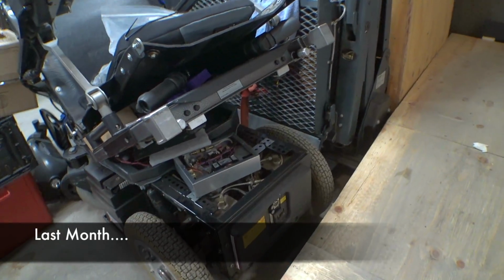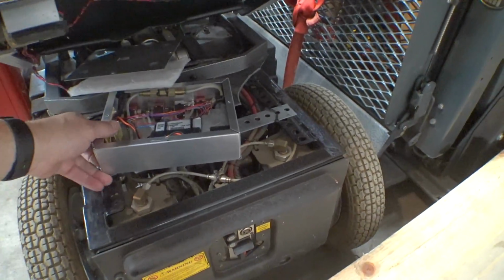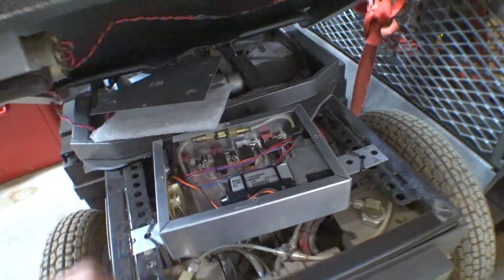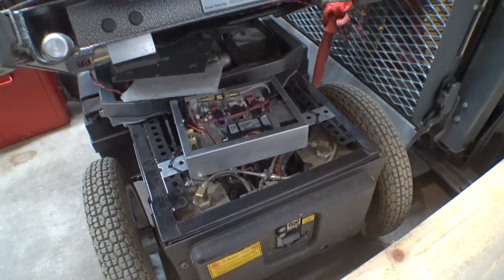Yes. So since I've been sitting here with my finger in my nose and not going outside, I've been playing around with this omegatrac. I had an issue with the air compressor on it. This is the air compressor box right here. There's a little pump and a bunch of solenoid valves and stuff. But the rear airbags were not pumping up on it. So let me see here. I think now I've got it sorted.